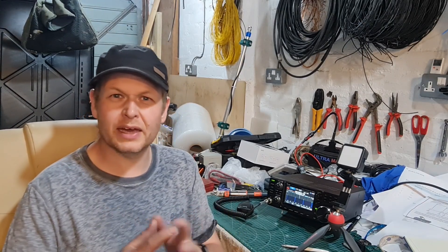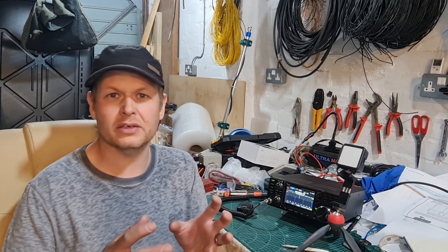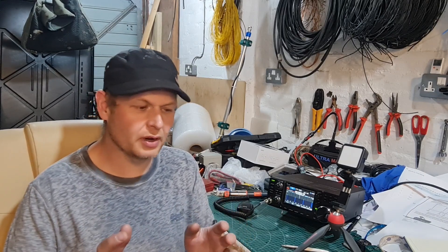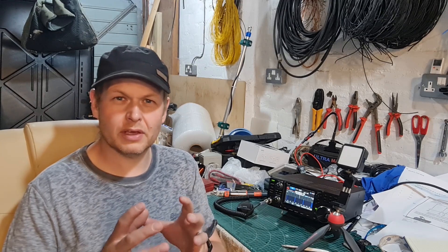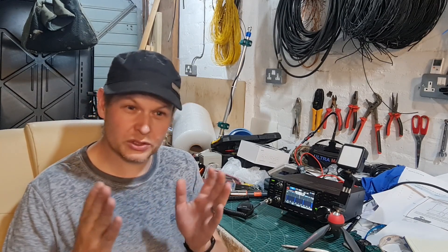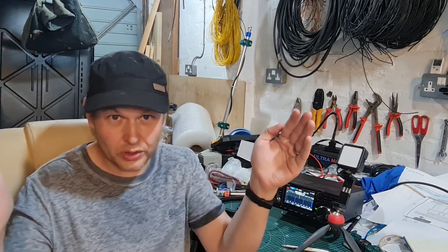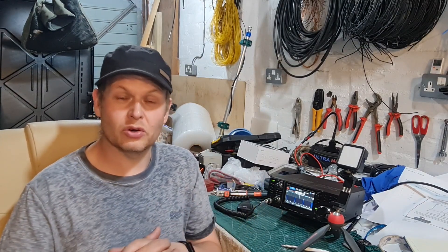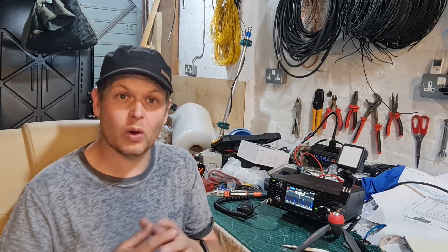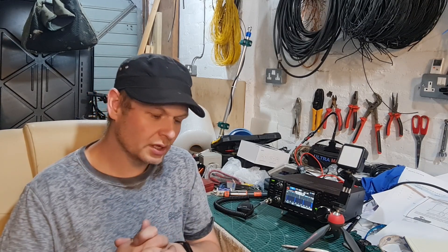Something curious about this antenna is it's quite high-Q, meaning it has a relatively low bandwidth compared to other verticals I've used — you're not going to cover the whole of 10 meters with it. I've got about 1 MHz of bandwidth at 2:1 SWR, which is more than enough. One other thing I noticed is this antenna is actually really quiet compared to other verticals, and I wonder whether the high-Q sharp bandwidth is rejecting noise on either side.